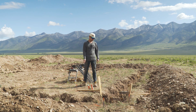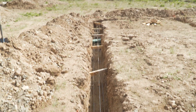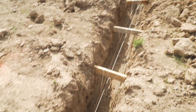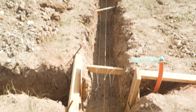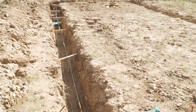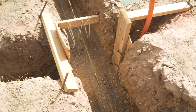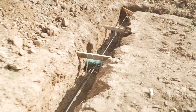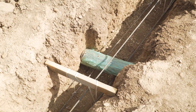I'll quickly walk around and show you what I've done hanging the rebar and for bringing in the utilities. Starting with the rebar and the grade boards — these two by fours that run along here, the bottom of them are at the grade height, so we're going to be filling concrete to the bottom of those. There's one roughly every six feet. And to avoid any ground contact with the rebar, it's all being suspended from those grade markers. Over here, this is where the fresh water is going to come in — that one is buried underneath the footing. The other two are going to be septic and electricity, and septic is going to run through the footing through a six inch sleeve, with the four inch pipe running through the middle.